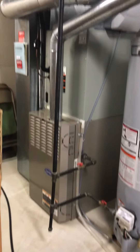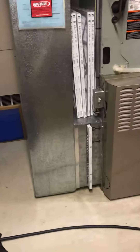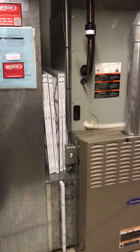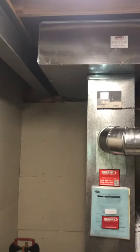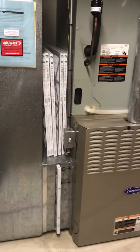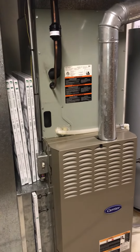It's 33 and a half inches to get underneath that coil. Looking at the width, just popping around this side — being a four-ton unit — I'll leave it up to you. If we can get the furnace underneath the coil, we'll come back with a new return drop and put a transition piece between the media filter. I've got 11 inches on the side there. The other option, if we have to bump the coil up, we might as well come back with a base.